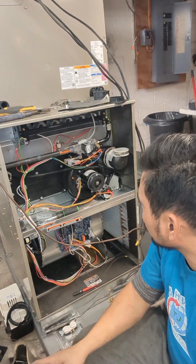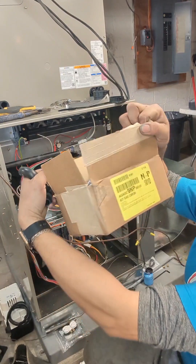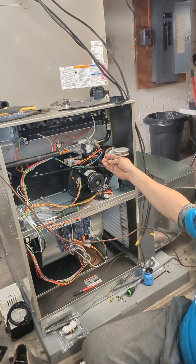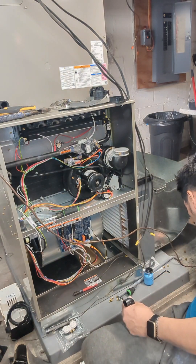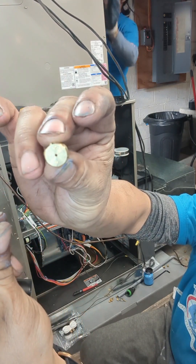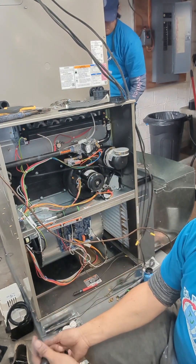So that's how you convert the gas valve. You basically change all the nozzles. You buy the conversion kit — this propane conversion kit has everything in it. It's a two-stage system, so there's a high fire and low fire stage. From natural gas, it has a big hole in the orifice. You have to convert that because propane has higher pressure — if you keep using the natural gas orifice it's too much — so you swap it out with the propane one.